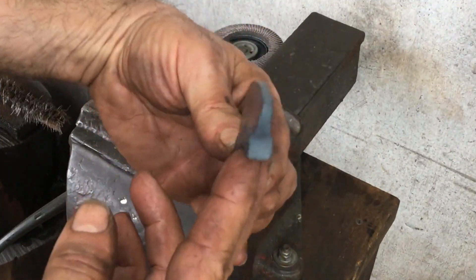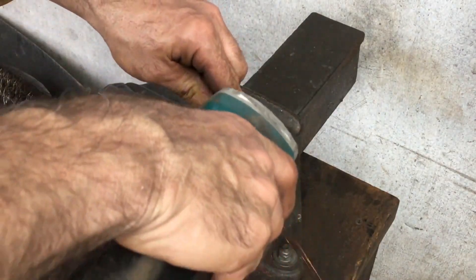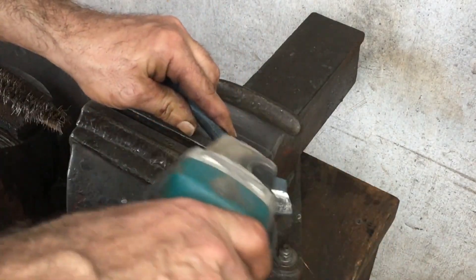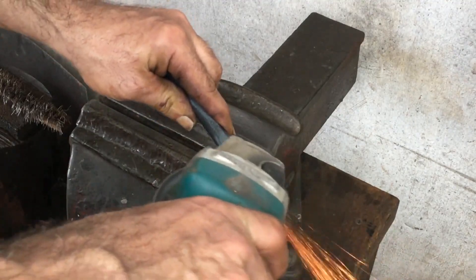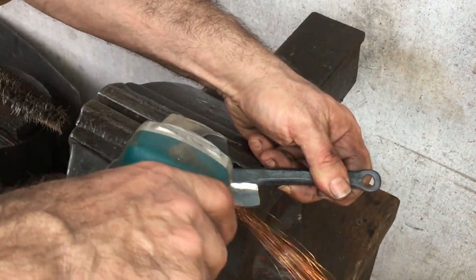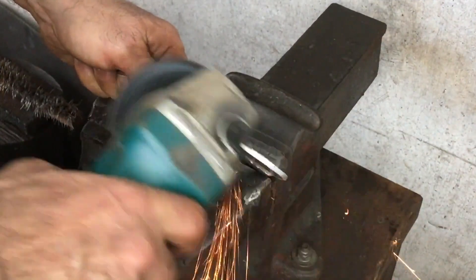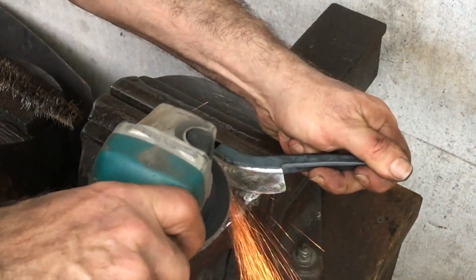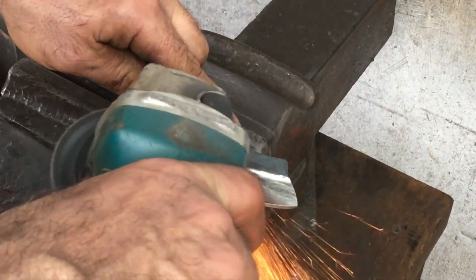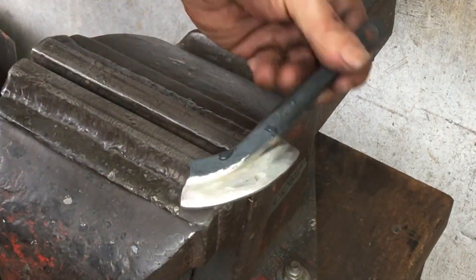The edge is obviously a lot thicker than it should be, but to this point the dies have worked very well, and I won't alter the dies until I use stock that's maybe about half this thickness. The line between the spine and the blade hollow has been delineated very well, and it makes it very easy for me to follow with my angle grinder. I can imagine the amount of grinding I saved myself by working this piece in the blade hollow bevel dies for just a few heats.